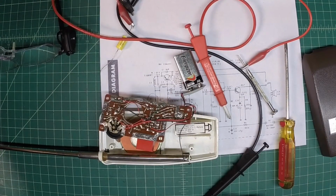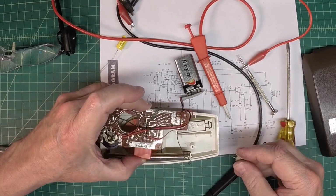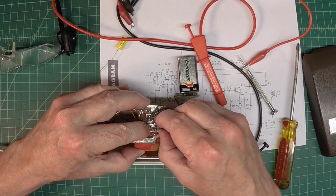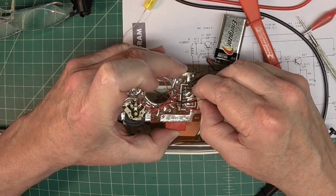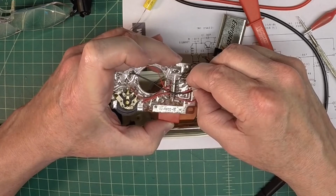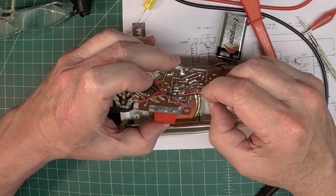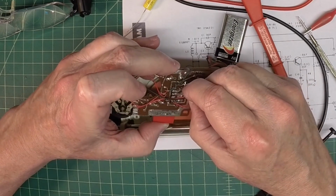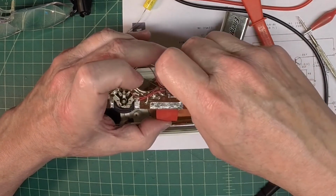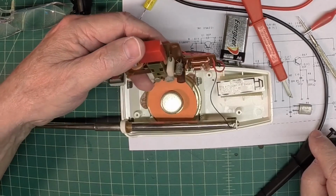And I'll turn on this receiver. Just turn down this volume. Now hit the transmit button here. What I'm going to do is just lay the crystal in here across the circuit. Alright, there we go. Trying to get a connection here. So let me desolder. There we go. I think I got a connection there. So let me desolder this other crystal that's in here, and then get this one in place, and let's just see if that resolves the issue.